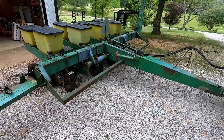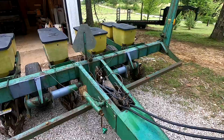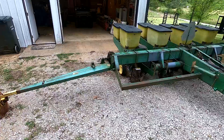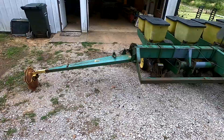All I need now on this unit is getting some grease in it and getting it lubed up. I've got to get my speed set on it so I can get my row count and row population like I want it. And I'm going to have to adjust the markers — or at least test them and adjust if I need to. I know they'll need adjustment because of moving the row units in narrower to 30-inch rows. But we'll get those adjusted and we're going to plant some corn, when it dries up that is.